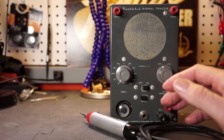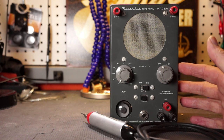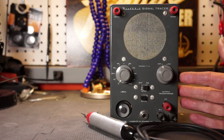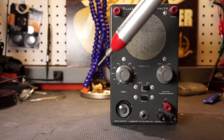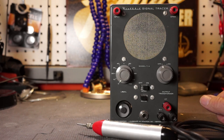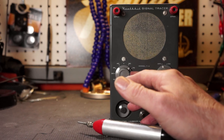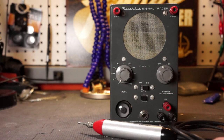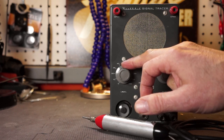The speaker is very useful with a signal tracer because what you do is look for signal at various locations along a signal path in an amplifier or radio. You take this probe from the beginning to the end of the path and touch different locations along the signal path. If you have signal there, hopefully you'll hear it through the speaker. At the beginning of that path, the speaker is going to need some gain control to pick up that weak signal — for example, at the very beginning of a guitar amplifier signal path, the signal is going to be very weak.